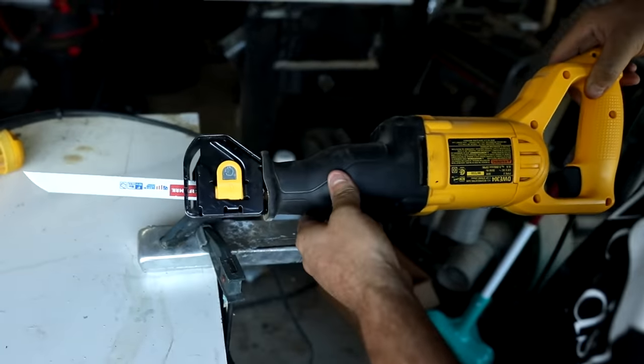Okay, the reason I'm adding marker to the tang is a technique in order to find the high points which are coming in contact with the finger guard from the inside. After you add the marker, go ahead and slide it on as far as it'll go, and anywhere the tang is coming into contact, it will leave a tiny mark from the marker. Those are the points that need to be ground down. And in order to grind it down, I'm going to use this tiny itty bitty burr to get inside the hole and grind down all of those marks. Repeat that process over and over until the piece slides all the way down onto the tang, and as soon as you get it fitting perfectly, be sure to do something very stupid.